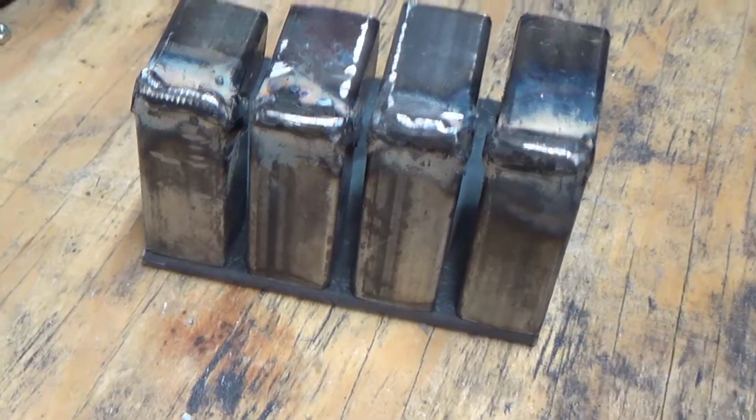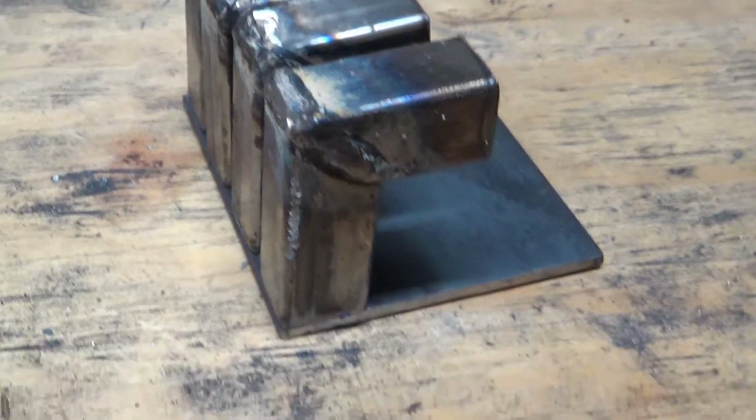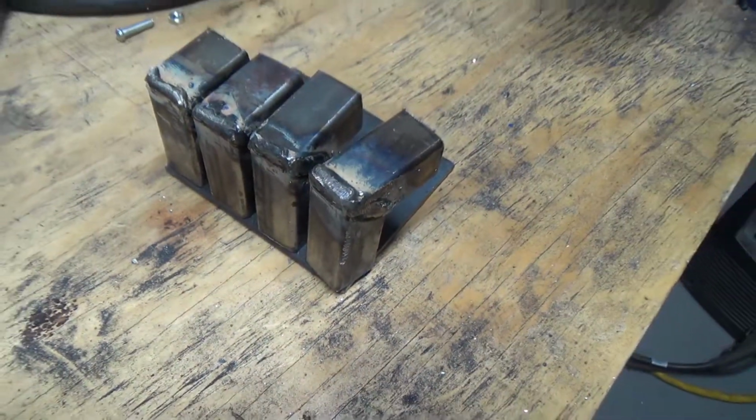Okay, so I just ground all the fingers and then lined them up on the back. So that's how they're going to be welded. And you can now get a much better representation of what the fist is going to look like. So now I just need to weld along the bottom, all the front there, the sides here, and then all the places here. I'm not going to be able to get to those inside sides in there, right there. But it should still be strong with the front and then the back welded. So it should be strong enough.